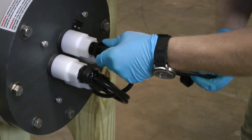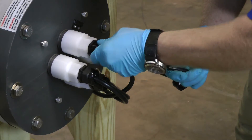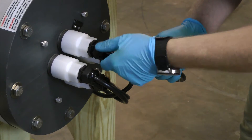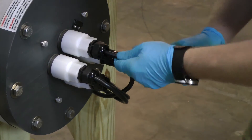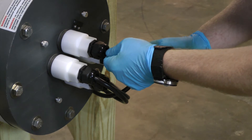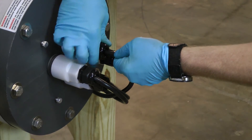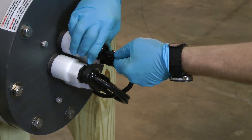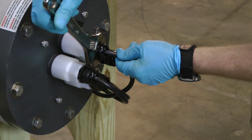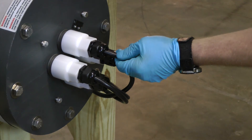Put your black watertight connector back on, making sure that's snug on there. Get your outside ring to your black watertight connector. Go ahead and slide the lamp all the way to the end of the cord sleeve, then bring it back about a half inch to an inch, holding it there until you get it snug on the outside nut. Go ahead and grab your 10-inch adjustable wrench and go about a quarter turn. And that is it.